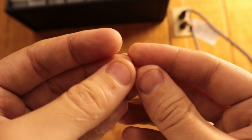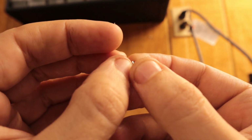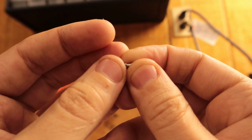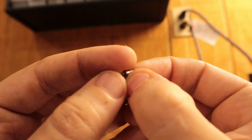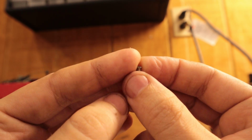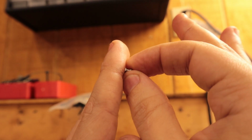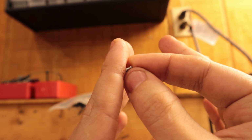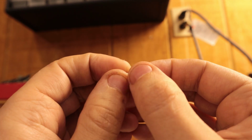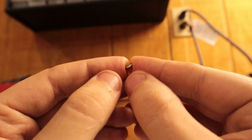Yeah, so something really important I found is when I transfer them, the marks in the subspindle collet dent the titanium that these are made out of. And so I wanted to use those triangles, the small triangle media, to see if I could deburr the edges. I don't know if you guys can see it, but there are jaw marks on the flats of this. And obviously I'd like them to be not marked up.